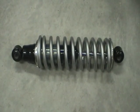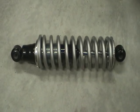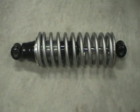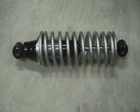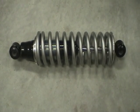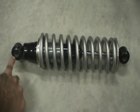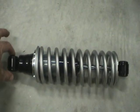The coilovers I'm using are pretty common. They're from Lindblad chassis. They cost about $100 a piece. 50-50 dampening ratio, not adjustable. Fully expanded, they're 14 inches from eye to eye. Fully compressed, 10 inches from eye to eye. And I intend to run these at 12 inches at standard chassis height. And they come with a 1/2 inch sleeve, about 1.4 inches in width.